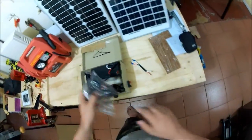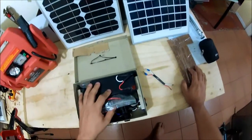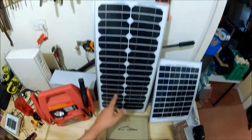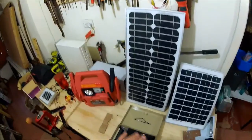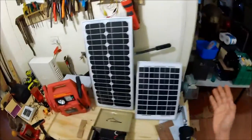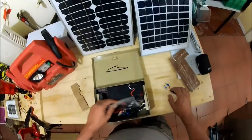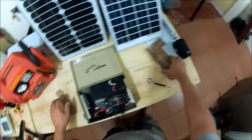The current size of this system is a 108 watt-hour battery — a 12-volt battery at 9 amp-hours — so a 108 Wh system. I mainly use the 20-watt panel to charge this and it can go from empty to a full charge in around five to six hours of sunlight, which is plenty considering we live in Australia. On an overcast day like today, you add the 10-watt panel to the 20-watt panel in parallel to give you a 30-watt setup and charge even faster — less than five hours, that's for sure.